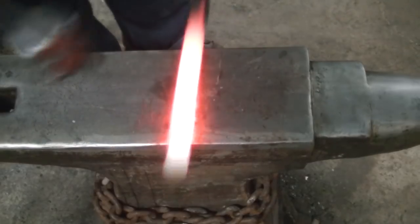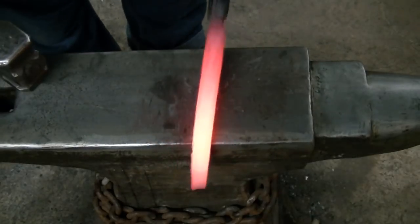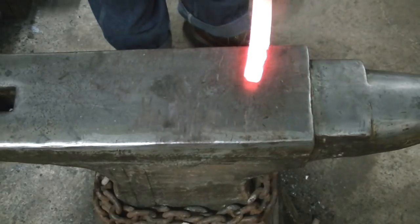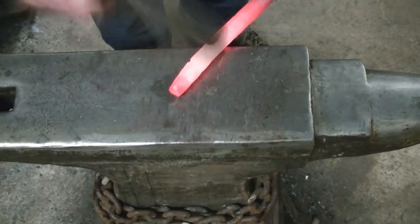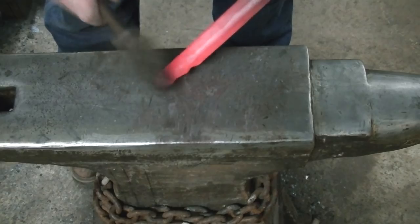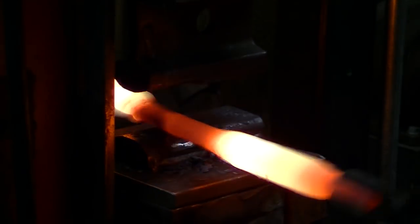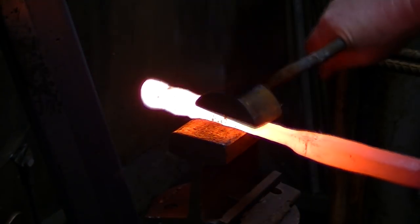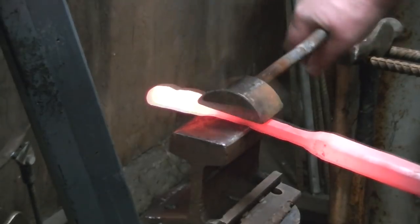We need to have some good control here. Basically what I'm doing is isolating two sections — I'm going to make this sort of a figure-eight shape on the end of this, and we're going to flatten it so there's a flat back and kind of a rounded face. We're going to put a skull on the end of this, and then we'll draw out a stem on one end at the top of the skull that we can hold onto while we're pressing this into what we're going to use as our drop-forge die.